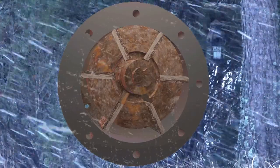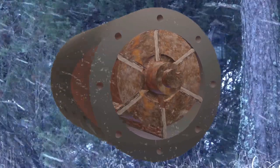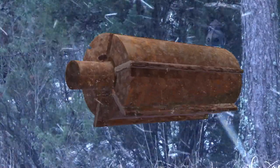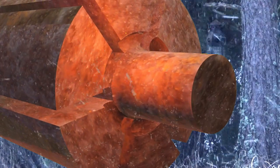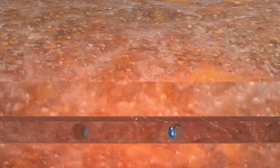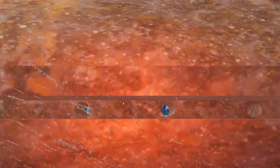The oil pump is there to start the oil flowing. It is not needed after some oil and air pressure is gained. The bottoms of the slots are interconnected by holes through the rotor. These holes are there to allow the oil to migrate under the vanes as they change position.